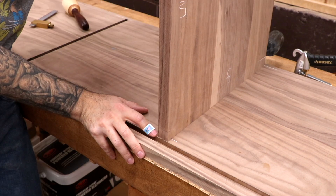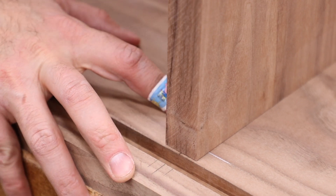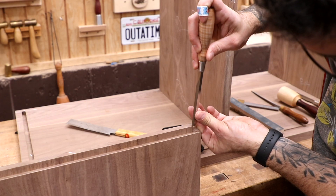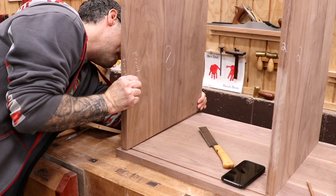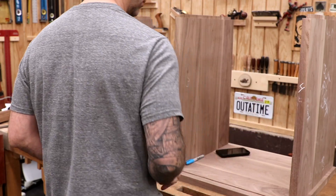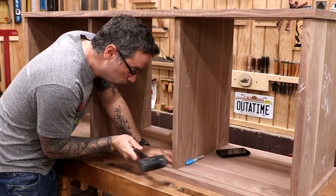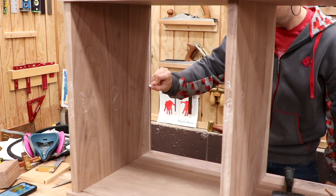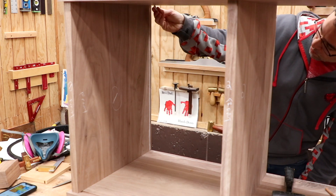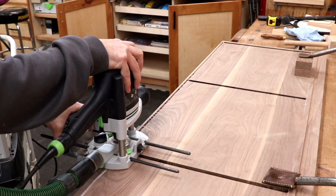At the front of the case, the partitions need to sit back about a sixteenth of an inch behind the sliding door groove so they don't interfere with the sliding action. All of the partitions and sides are processed in the same way, and when I'm done I number each one so I can reassemble them in exact order. With the top and bottom in place we can really evaluate the fit and plan our next move, which is the back panel groove. This groove goes around the inner perimeter, so I need to cut the groove in the side panels as well as the top and bottom — a quarter-inch bit and edge guide does the trick.